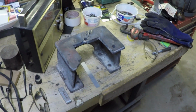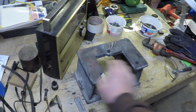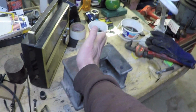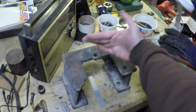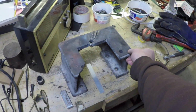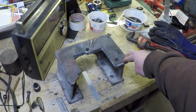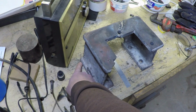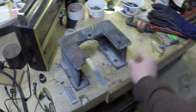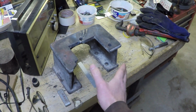First, I'd put it on my surface plate, and I'd determine exactly how high the high spot is. In other words, it's not rocking in this axis from this corner to that corner. It's definitely rocking in this axis from this corner to this corner. So what I'm thinking is, if I can determine, when this is pushed down to the plate and making contact with the plate, how high this corner is, split the difference and shim both this corner and that corner the amount that it's out.